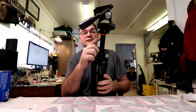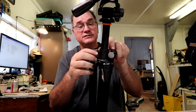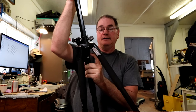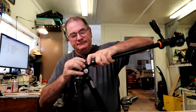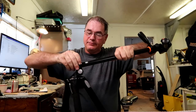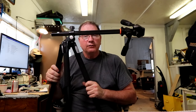Then there's the feature of being able to take the main shaft and the head, pull it out, and set it at a 90-degree angle so it'll hang over your work. Let me show you how this is done. Unclip this, you pull it out, you push the little brass button that I hate to get it out. Bring your hinge up, push your little brass clip in that I don't like — I don't like struggling with this thing, I don't know why it does that. You'd think they'd have done something a little bit better. Tighten that down, pull that clamp down, and now you have 90 degrees where you can hang it over your work.